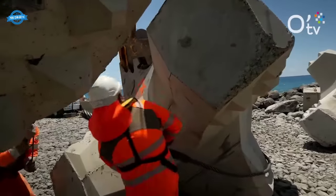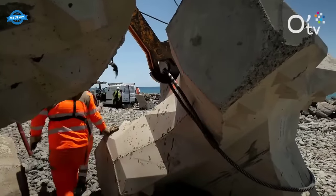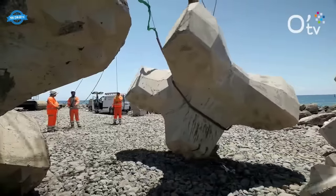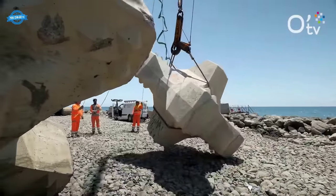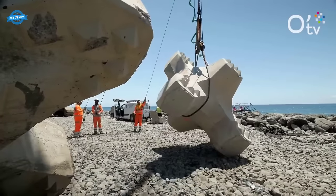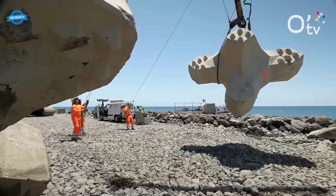Various earthwork workshops were then responsible for carefully distributing the quarry materials onto the platform. The materials, typically measuring 0 by 50 millimeters, were strategically placed, layer by layer, to create a strong and solid embankment. Each layer was compacted to ensure optimal density and stability.